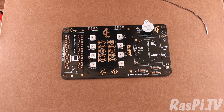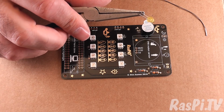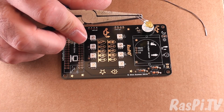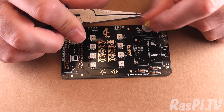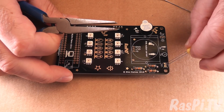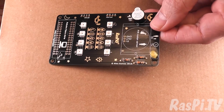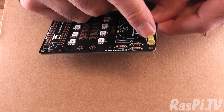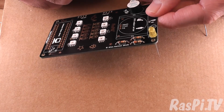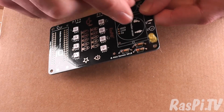Next stop, LED. You'll notice on the LED one side has a flat. That's also the side with the shorter leg. Both of those are ways of telling you that that side is negative. The longer leg is positive, and the longer leg we want to go on this side. So when the LED goes down onto the board, you should see it fits inside its footprint. If we put it the wrong way round, it doesn't fit properly. Yeah, because the flat's on that side now, and it shouldn't be like that. Flat should go to its correct side.